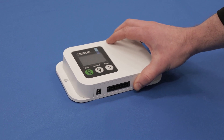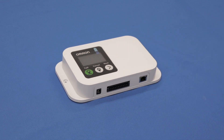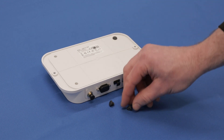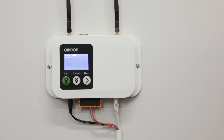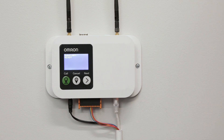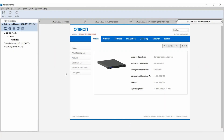The Mobile I.O. Box can be placed on a horizontal flat surface without fixation. Mount the four rubber feet by pressing them inside the holes at the backside of the Mobile I.O. Box. If mounting on a wall, fasten the Mobile I.O. Box directly to the mounting surface using M4 or number 8 screws. Screws are not included in the package. Make all necessary wire connections to the I.O. connector and then insert the connector into the I.O. Box. Connect the power connector and insert the barrel connector, then plug in the I.O. connector. The Mobile I.O. Box is now connected and ready for configuration.